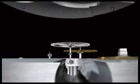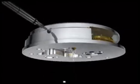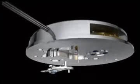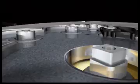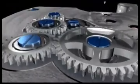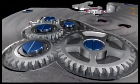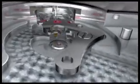Lubrication-free mounting of rotating parts in watch movements is the dream of all watchmakers. Eterna has taken a huge step towards achieving this dream. The Eterna Calibre 3800 is the first watch movement in the long history of watchmaking in which the barrel drum, the barrel arbor, and the crown wheels are mounted on lubrication-free ceramic ball bearings. With this groundbreaking innovation, Eterna is setting new, previously unattained standards in terms of precision and efficiency in the mechanical watch's motor.